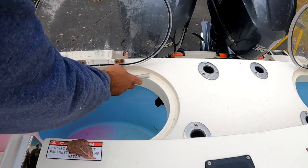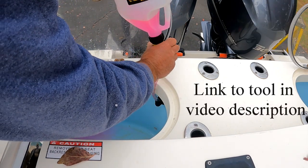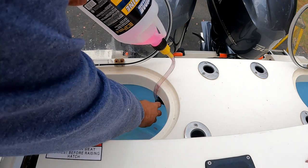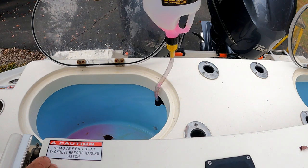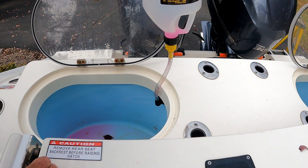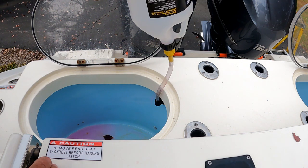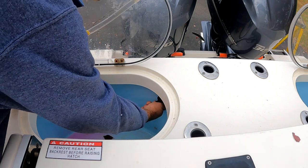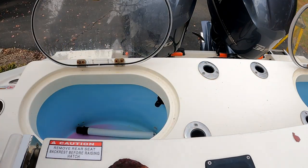On the starboard side, I'm going to use a different method just to show you there's more than one way to do this. This is a gear oil filler neck — got it on Amazon for $10, I'll have a link in the description. It fits gallon jugs and quart jugs and has a little on/off valve. Here I'm using it to insert the antifreeze into the filler portion of the live well, and it's going to drain straight down into the pump. Because I have the seacock open, it's going to drain right out of the intake — so instead of coming from the outside going in, I'm going from the inside going out.